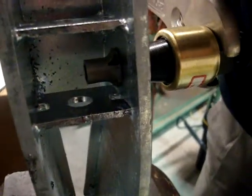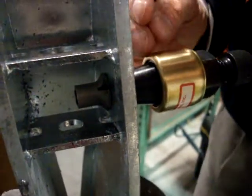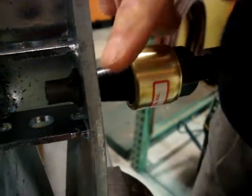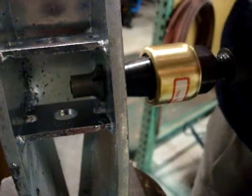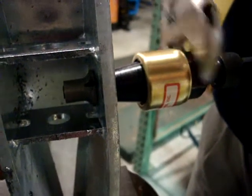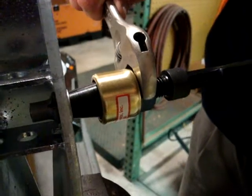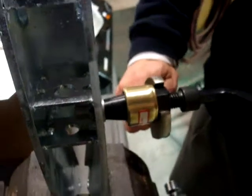You can see that a 1/4 inch is on the top end of this particular fastener's grip range. We're not going to get a great big plus pattern, but we will get some bulge, and that'll hold the fastener in place. I'll turn it one little bit more. You can feel a definite stop. It just gets progressively more difficult.